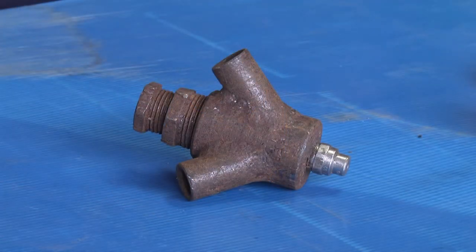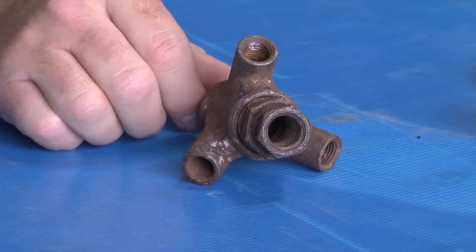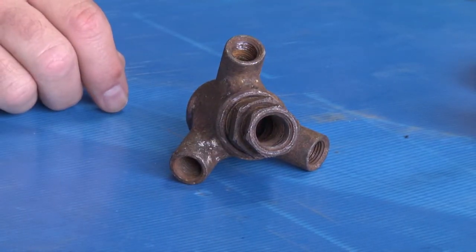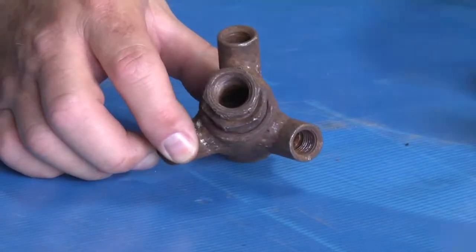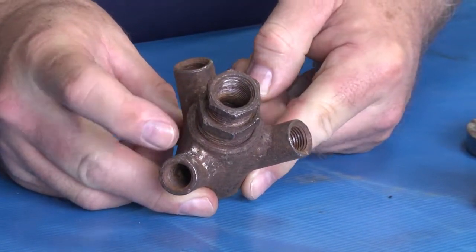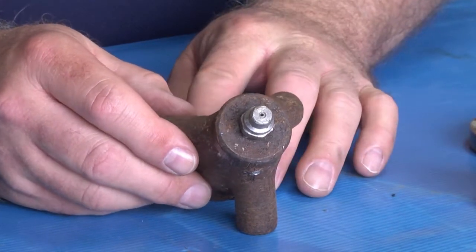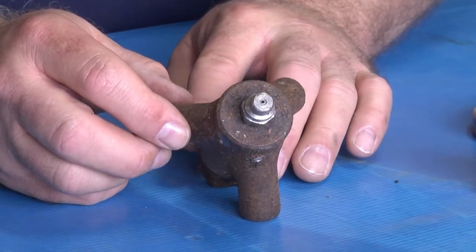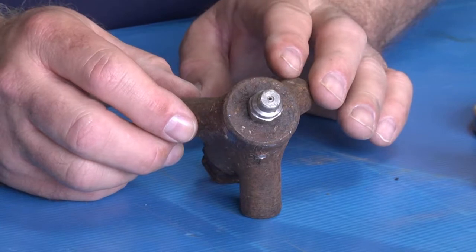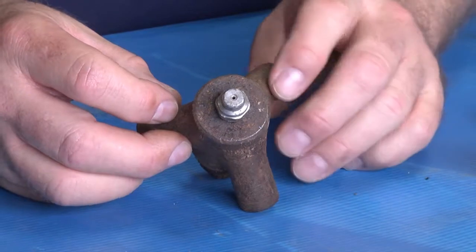If this doesn't shock the heck out of you, you probably don't need to be water blasting. These are not even Schedule 80 couplers. And this is a crow's foot that's not rated for any pressure. Somebody decided that they could make a good pipe cleaning tool out of whatever they had at hand. This should be very, very scary. Never, ever try to make your own water blast system. Go to a reputable manufacturer where you have assurance that everything has been tested and certified up to the pressures you will be using.